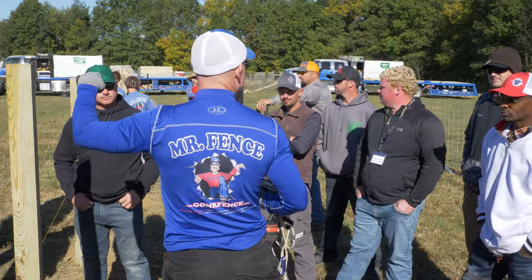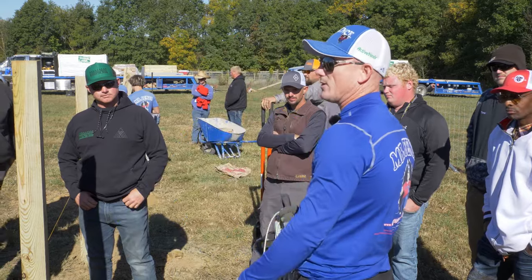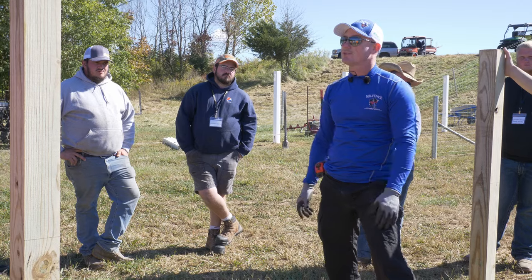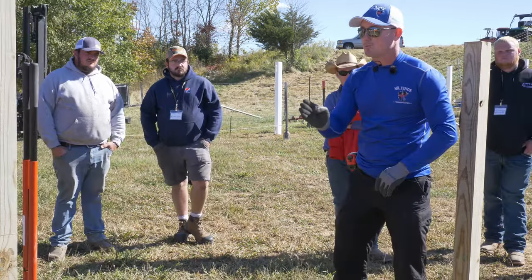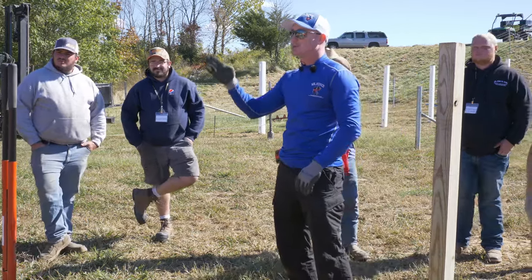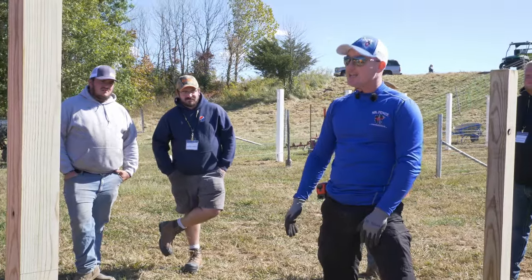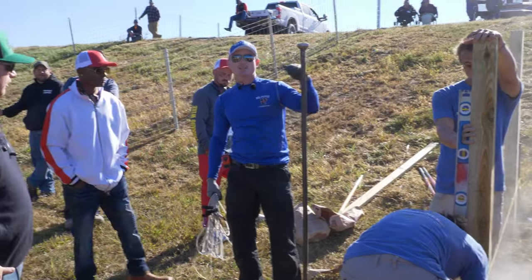I hate seeing posts cut off one or two inches, because that's one or two inches more that could have been in the ground. Why are we throwing that away? We paid for the whole post, let's use the whole post. Number one callback we get: 'my fence is warped everywhere.' Our contract literally says we guarantee your wood fence to excessively warp, crack, twist, split. Are you sure you want this? And they're like yes.